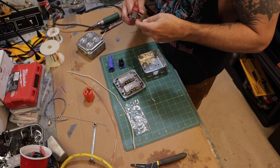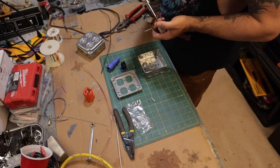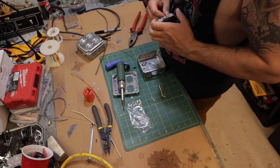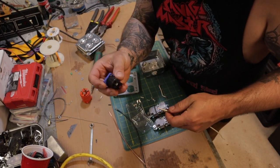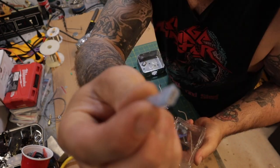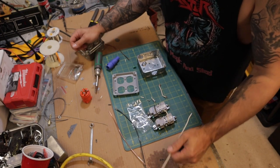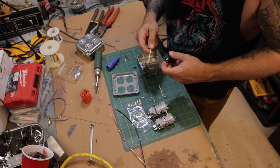We'll start by just joining the two together. After you have these two kind of joined together, I usually just solder them in place — stick the wire right underneath there, get it plenty hot, and drip lots and lots of solder in there. You don't need to necessarily solder these in, but if you've seen any quad box at any venue across America, you know how messed up those connections get. So just solder it — I try not to rely on any screw terminals if I don't have to. Solder everything, because you're not going to find out it's broken until you really really need it.